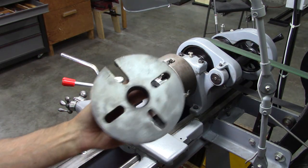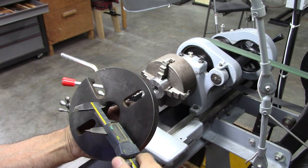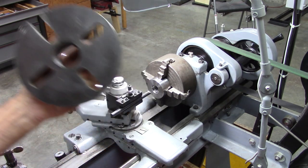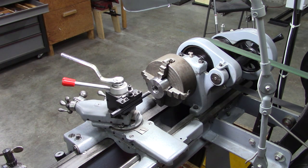I've got a 1.5-inch backing plate here and I've measured the internal threads — it's 1.341 to 1.347.